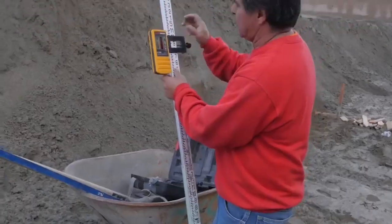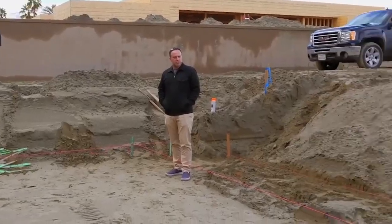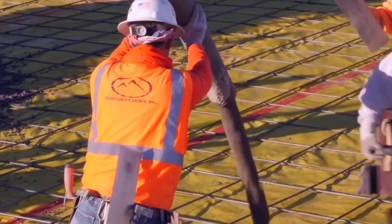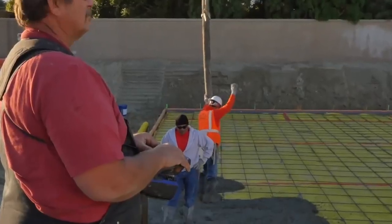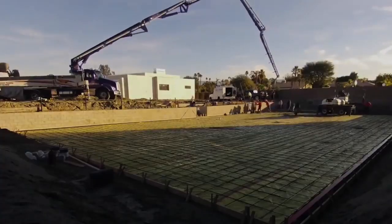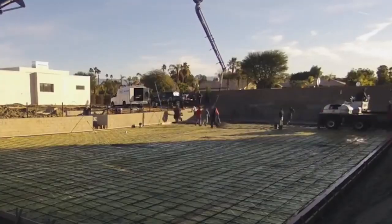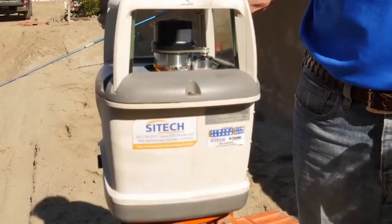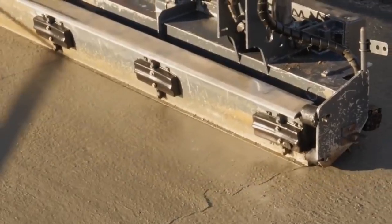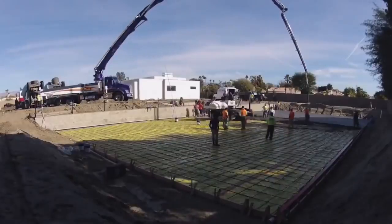Concrete or clay-dite concrete is poured over the sand. The surface is preliminarily reinforced, and in order for the tennis court to be of high quality, the concrete is poured without interruption in one cycle. This eliminates the presence of surface joints. Before the surface finishes drying, it is leveled.